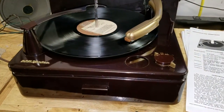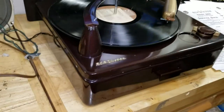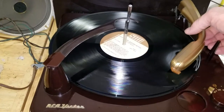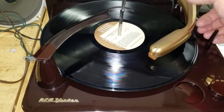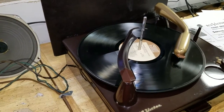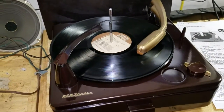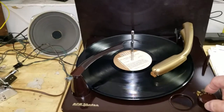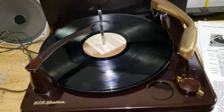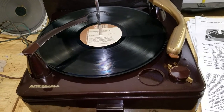RCA had some of the best stuff of its time. This thing was made in 1950 or 51. I basically cleaned it up, disassembled it, lubricated it, and made all the adjustments. There's a little bump there on the record — I have to be careful not to bump the bench. Now I want to take the record and shut the machine down, so we just hit the reject. It will set the tonearm back where it's supposed to be, and shut her off.